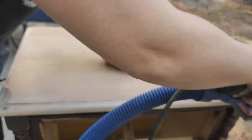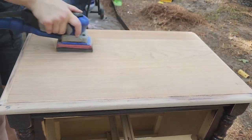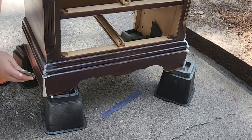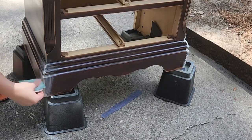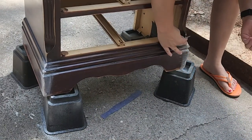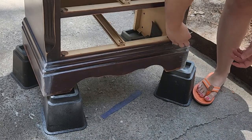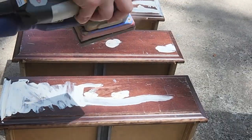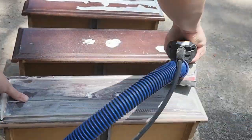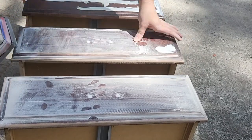On the edges, take it slow and don't be too aggressive — make sure you're not damaging the veneer. In the corners I hand-sanded off the wood filler. I use Dixie Belle wood filler because it doesn't stink, dries really fast, and is easy to sand, although it shrinks quite a bit so you normally need a couple of layers unless you overfill it like I did. Then I do my scuff sanding on the drawers to get them prepped for paint.